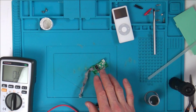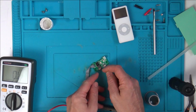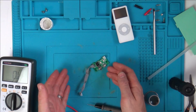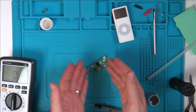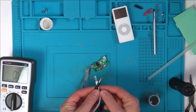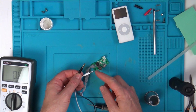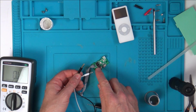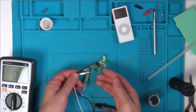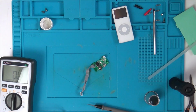Whoever designed this, I don't think they've put in quite the right headphone jack, because if they had just done it like this one, where the two contacts are in the same place, then all headphones would work, whether 3 pole or 4 pole. But in this instance, this radio is only ever going to work with these. I'm wondering how many of these were returned to John Lewis for that, when it was just a design problem that could have been easily solved, because the price difference would have been pennies, or there might not have been any real difference. So yeah, that's not really very good, is it?